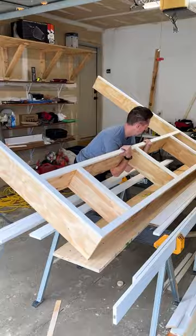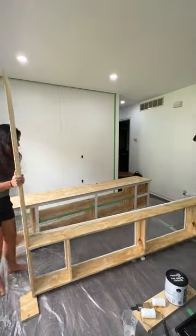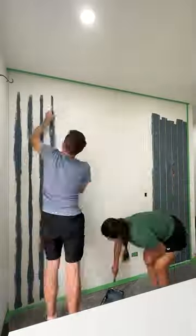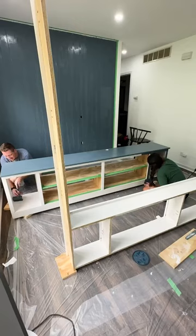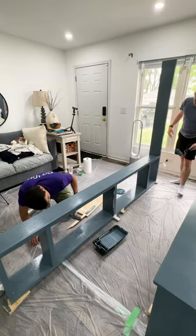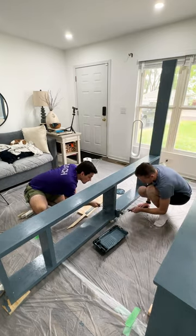Once that was built, I just needed to fill nail holes so they're invisible when we're ready to paint. But first I had to prime all the bare wood surfaces because it seals the wood grain and makes it less visible when we apply the actual color. The exciting part was watching the color come to life — we went back and forth a lot. At first we thought of black, or a more neutral beige, but we ended up deciding on a color that would create a little pop for the room and look like it belonged to the person who lives here.